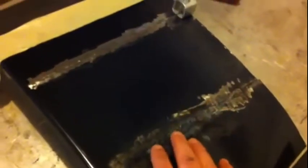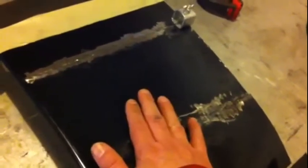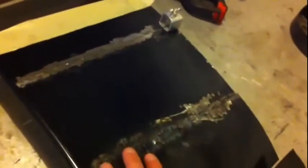And I must say, after my experience with this, even though it was my first go at it, I didn't have a lot of clamps pinching the metal together. So as I was welding, I guess this was warping or both. And I had more of a gap between this piece of metal and this piece of metal at the flange. So basically what I was doing was filling this huge valley with weld. All this metal you see here is weld wire.